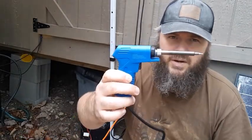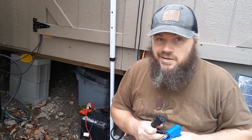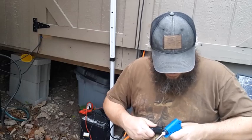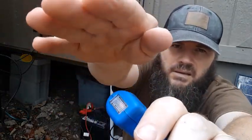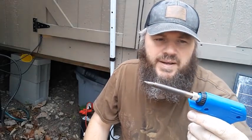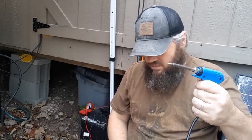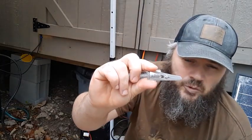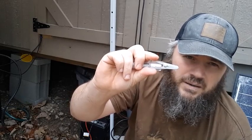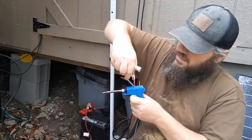What we're going to want to do is gently twist them just to make them uniform. I've got to tin the wires next, so we've got our solder gun. We've got our AC powered by our solar inside — I know the irony, right? Using solar to fix solar. This is a booster, so instead of it heating up at whatever amps, when I press this it'll double or triple the amps — you've got to hold that in for 30 seconds. I like to use solder with a rosin core already inside of it. These little aluminum clips are a heat dissipator — they go on the furthest part of the wire near where it's exposed. Give the end a little twist.